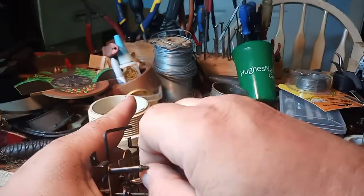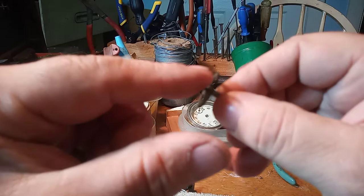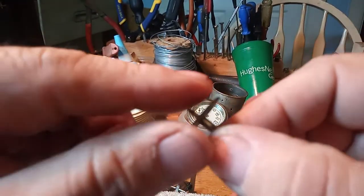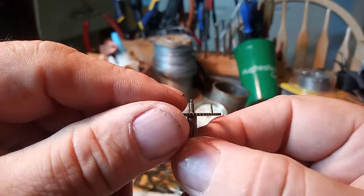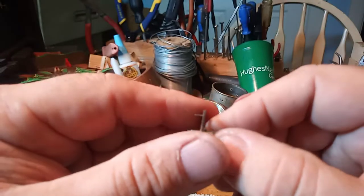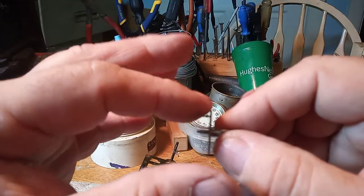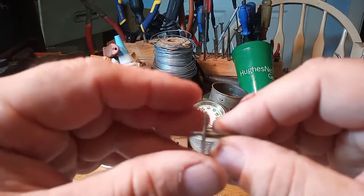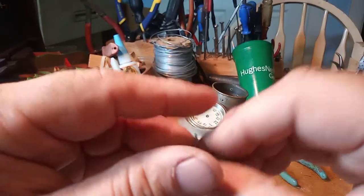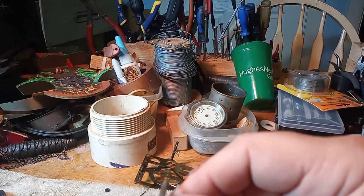You have what's called the strike side third wheel. The strike side third wheel has a warning pin on it. This warning pin has to be at a 90-degree angle — that's what catches the rack stop lever to stop the clock from cuckooing afterwards, and also to put it in warning. That's why it's called the warning strike third wheel.